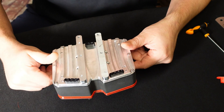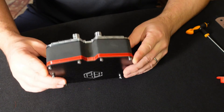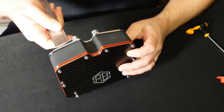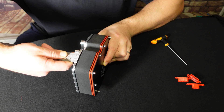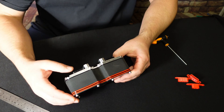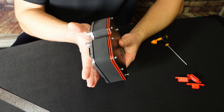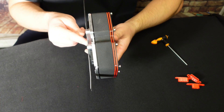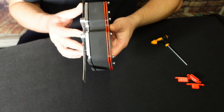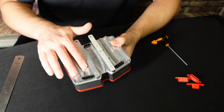There is the box. The base of it is aluminum, CNC'd out. It is quite thick — about 8 millimeters — which is quite good. So all the heat will be drawn away from the ESC itself. After this ESC box lands on your deck, you will have space for your cables and also for some airflow. This base gets cooled down a bit with air going through these fins right here.